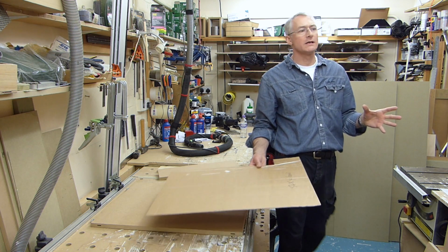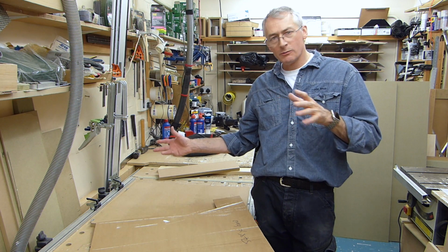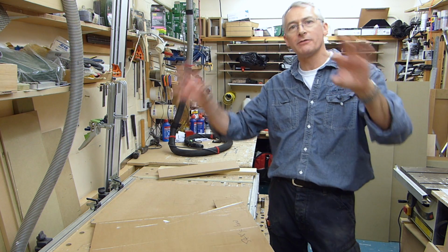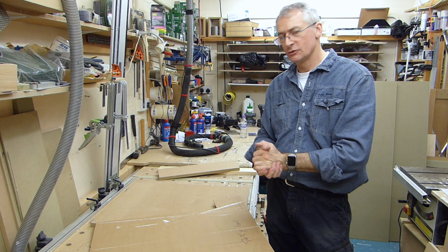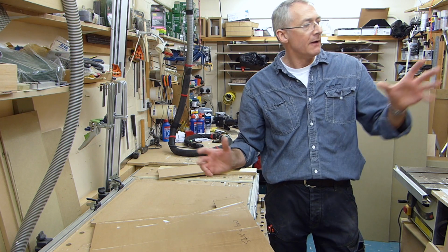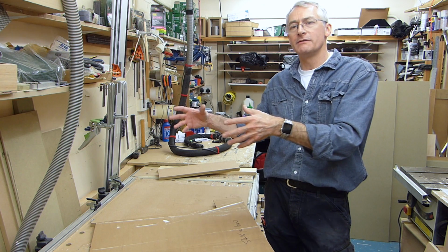So we've got our carcasses cut to size, all the shelf pin holes are done, all the domino mortises are cut. These are very ordinary, very standard carcass construction, 18mm MR MDF all the way around, dominoes, carcass screws, lots of glue, boom, job done, 6mm MDF back, stapled on afterwards. Very simple, very straightforward. The run of cabinets is a 900 wide double, and 2 550 singles, more or less.